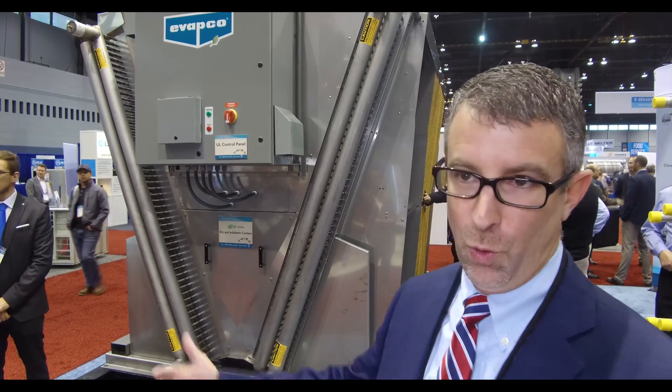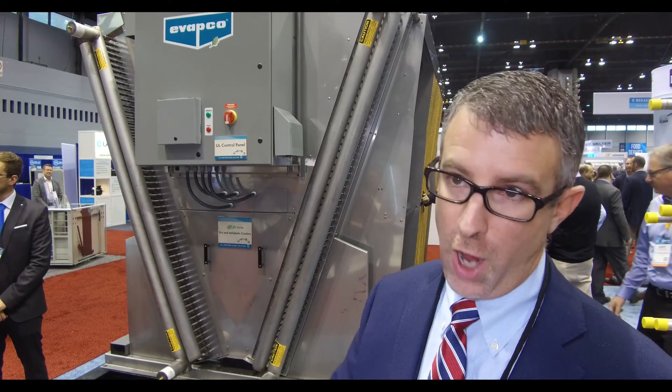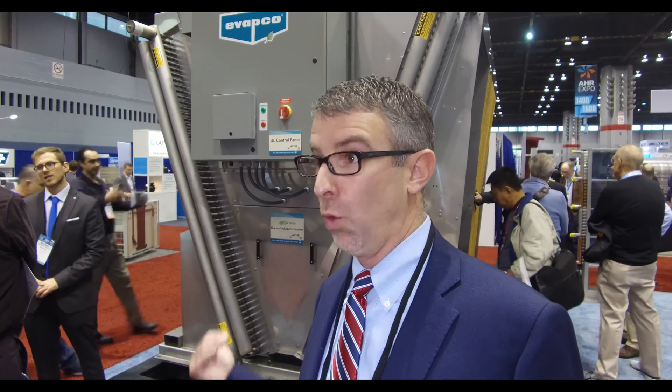It's a global product — it's the way the market tends to be moving, away from evaporative to the hybrid type of technologies. This is on the lower end: you can say dry with a little bit of wet. As people try to save more water, this will be the technology they look at. We also have in some states and countries concerns with Legionnaires disease, and by using less or no water, that concern is completely gone.